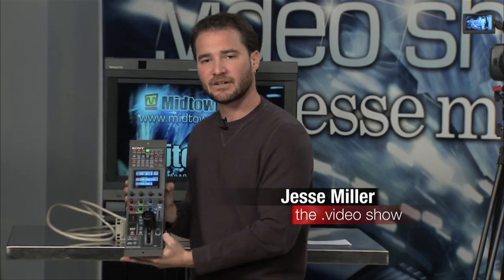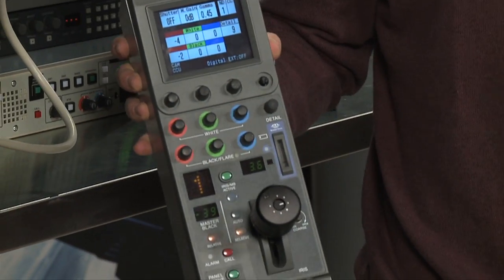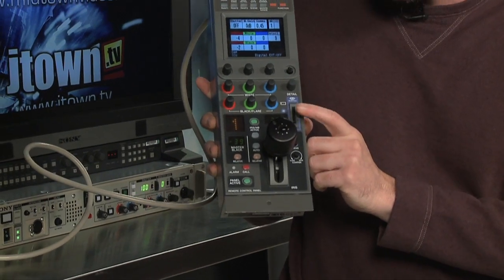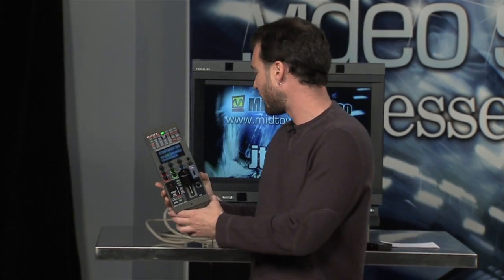This is an RCP 750. There's also a 751, the difference being joystick versus dial control. There are a couple of other paint boxes that are compatible with this CCU, but the reason I want to show you the 750 is the memory stick. You've got five cameras on the set and you want them all to look the same — high production value multi-camera production. You can't settle for one camera being a little off on the greens and one camera being a little off on the reds. So you hire a great engineer to paint your cameras, and in order to save setup time, you take one camera, flash it back to factory defaults, set it up, get into your multi-matrix, dial up your reds and blues, make your gamma decisions, make your knee sloping decisions, and really dial up the look that you're after.